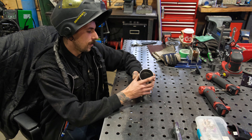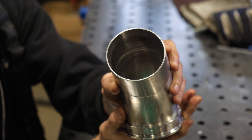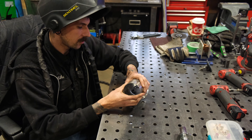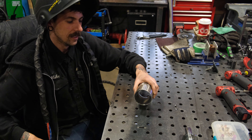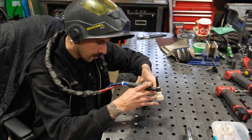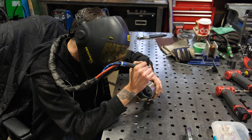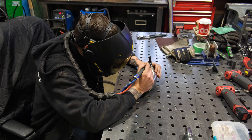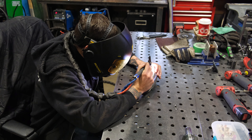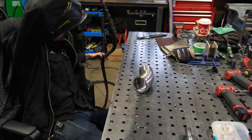A lot of people ask how do you tack this — you don't even need filler rod, because you've concentrated so hard on your prep work. Look at that fitment. It's a straight piece, we don't have any marks. My grubby little handprints are all over these right now so I'm going to clean these all before I properly weld it. I usually run this — it's like 16 gauge tube, so like 65 amps. Line up your sections, get happy with it. You're just melting them together. Let the gas cool your tack. Ready to rock.